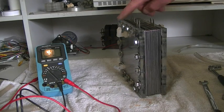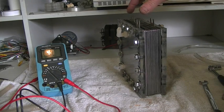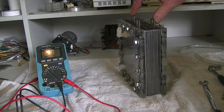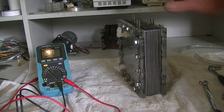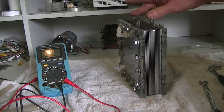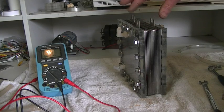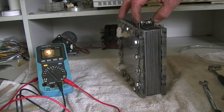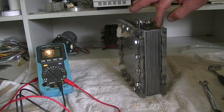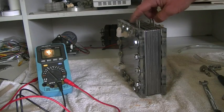The reason fluid doesn't flow from one side to the other is that the center plate is solid — it has no holes — because this is designed to be two individual cells in one. Our two end plates will be one polarity, the center plate will be the other polarity, and then we have our six neutral plates in each of those half-cells. There is still a potential problem you can't get away from even with this design, but we'll look at that later.